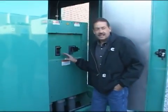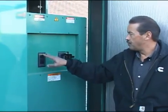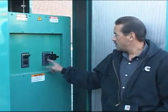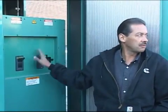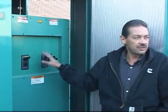This is unique in the fact that it has two circuit breakers on it. This left one is for your transfer switch downstairs — the automatic transfer switch, which we'll see in a little bit. This one is for the fire pump — feeds the transfer switch for the fire pump. Obviously they're going to both always be on, but in case you do need to isolate them for some reason.